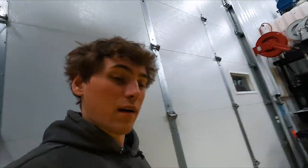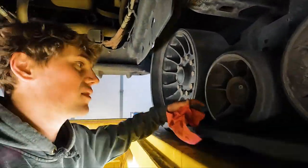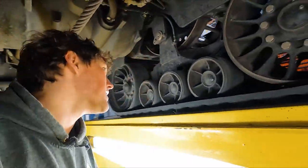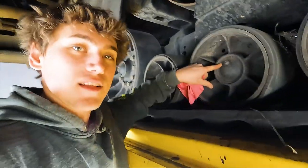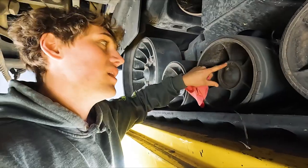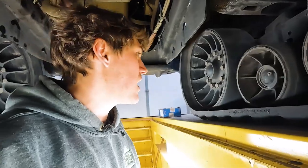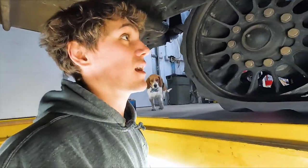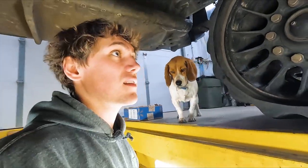Now the fun part. They got pluses and minuses, I guess, of working down here. The plus is, you know, everything's right here, and you aren't on your knees. The downside is everything is right here where danger is. These are big giant snap rings in here, and the plier sometimes slips out or kinks sideways, and bing, she goes flying, and it's not somewhere you really want your face, but it's better than laying on your side on the flat concrete. I'm sure there's a lot of people watching that knows exactly what I'm talking about, so I'll take the risk level.